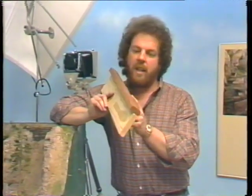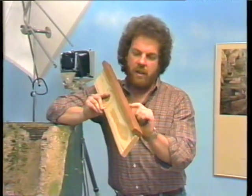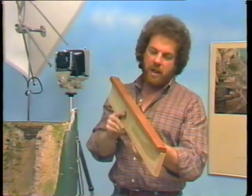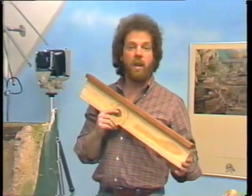L girder. One by two on top, glued. Line of glue here, bead of glue, then screwed on the top, two by four on the bottom. This is our main support, albeit small. This illustrates what we're going to be using for our main support and benchwork building.